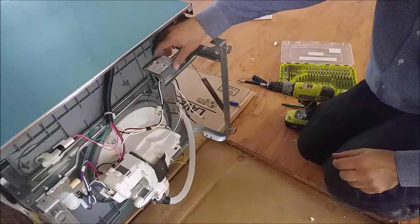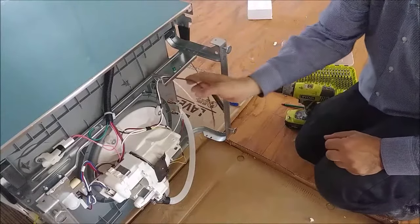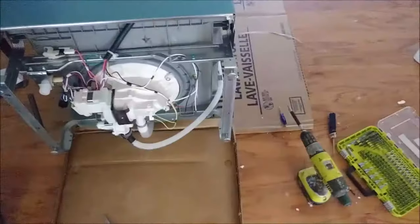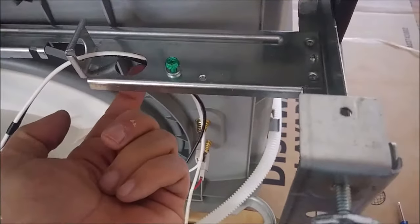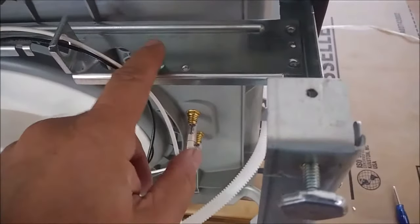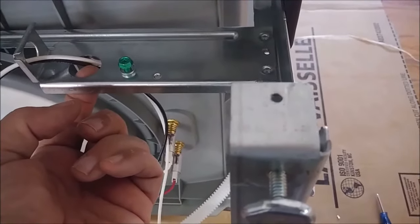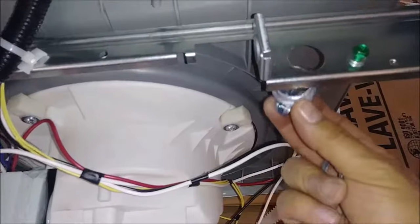Here is the box and what you see here are these wires — let me show you from close proximity. The cable is coming from here. We are going to put our cable here and we need to use a special conduit. It will connect with these two wires and with the ground which is here. I just want to see if a 3/4 inch conduit is okay or if I need a half inch — it looks like I took a 3/4 inch.